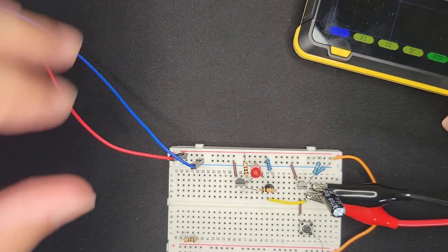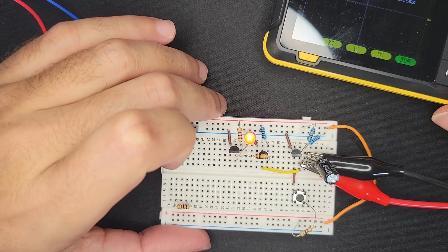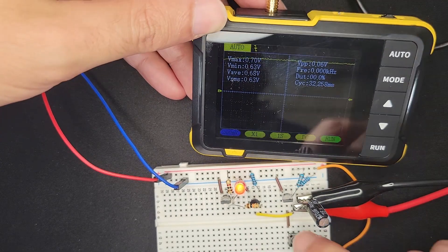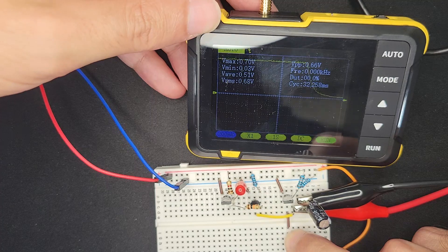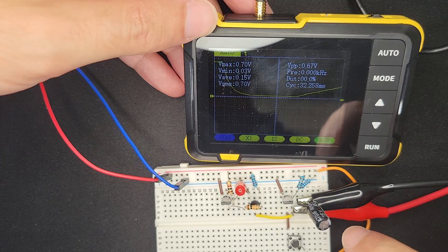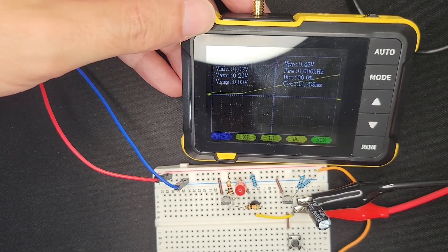The capacitor is definitely charging — going up. The LED should be turning on any second now — and there it is. Now we need to check what happens when we press the button. If I press the button, it drops super rapidly, and that's exactly what I want. If I release the button, we see it climbing again. So this is basically in reverse — we need to invert our button signal, and I think we're kind of there.